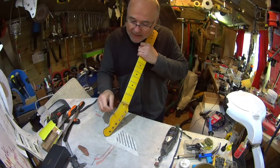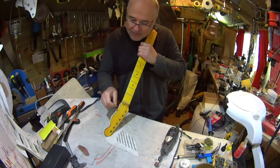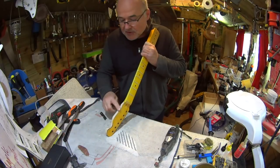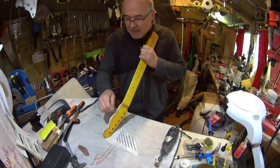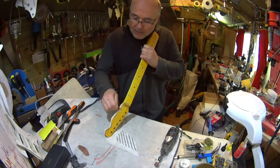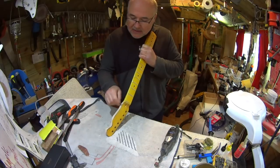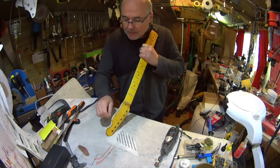But a sharp blade is a really nice way to work with wood. As you're coming up to your guideline, for example, you can see exactly where it's cutting, flattening the wood, and you can see the bits that are down or uneven. There's something nice about the speed of it. It's very human and very controllable. You're never doing too much at one time, so disasters aren't really going to just leap out and grab you, abracadabra.